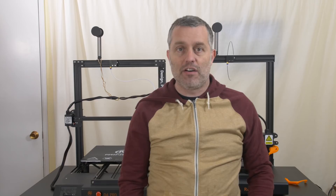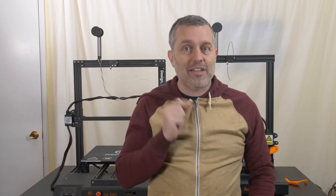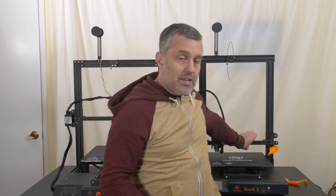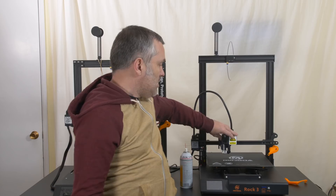That's the best technique I've come up with. Use a brass bristled brush and clean the bristles — straighten out the bristles every few hours of printing, just when you're checking up on the printer. This idea to put a brass bristled brush to clean your nozzle is not originally my idea. I got it from the E3D tool changer. The slight tweak I did was add it to one of these Mendel-style printers, because they can over-travel — the 2020 bar sits in front so the wheels can travel in front of the vertical frame piece. This is not an option for a Prusa.